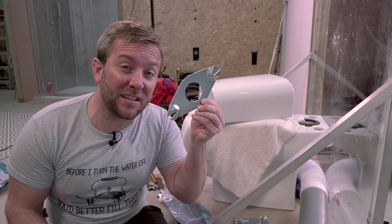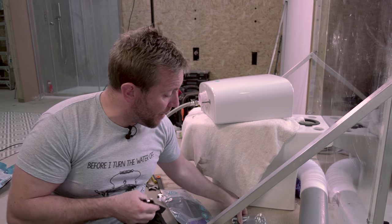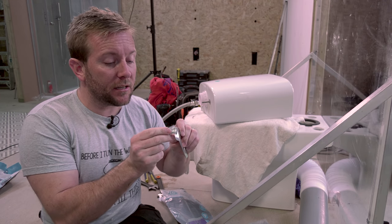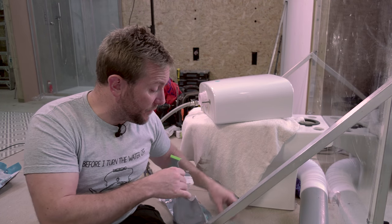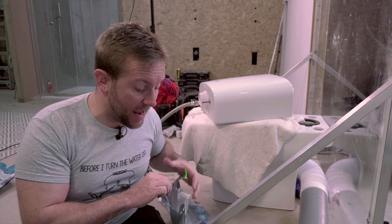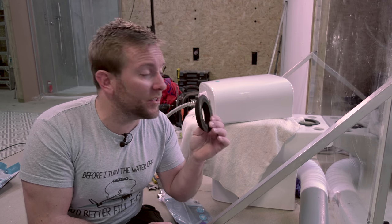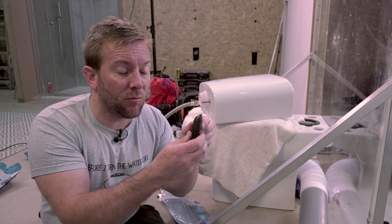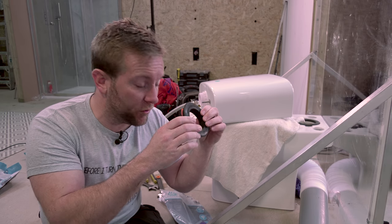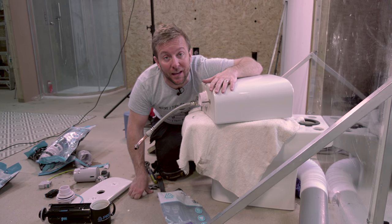Certain toilets have different clamping methods, so sometimes you'll take the system off and find something like this underneath. All you need to do when you put the nut back on is make sure this is underneath that nut so it's clamped up, and then you have a couple of little screws that go on the outside and screw down through the toilet to clamp everything up — a similar principle, just a different way of doing it. I'll be doing another video on that soon — if you want to find out, search our channel for how to change a siphon. Another thing worth buying for this job is what we call a doughnut, because sometimes the supplied ones aren't good enough. The replacement ones you buy are a lot thicker and chunkier, giving you a much better chance of a really good watertight seal. So without doing anything else, we're now ready to put our toilet back on, connect our flush, and get everything going again.